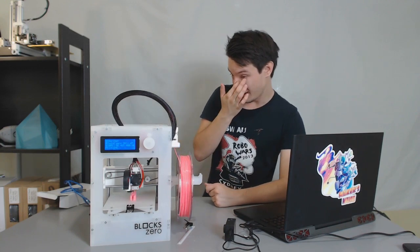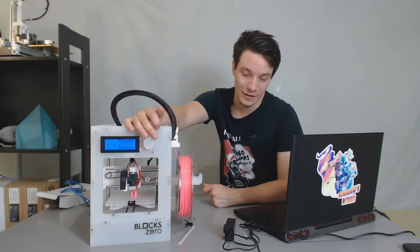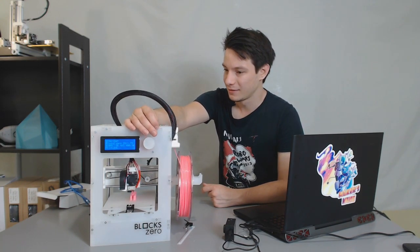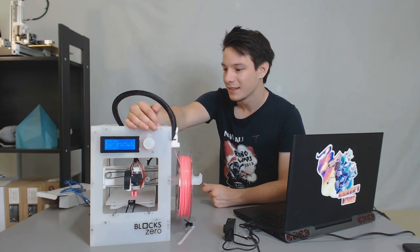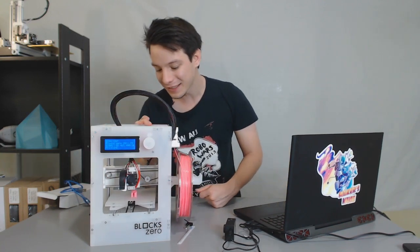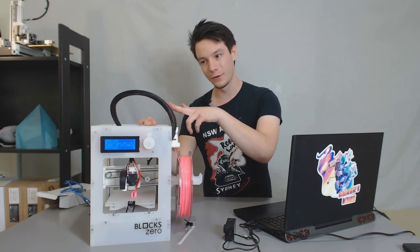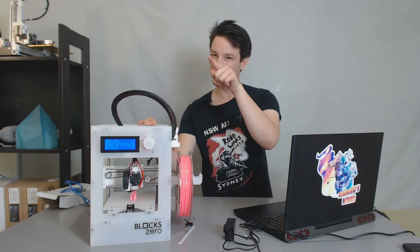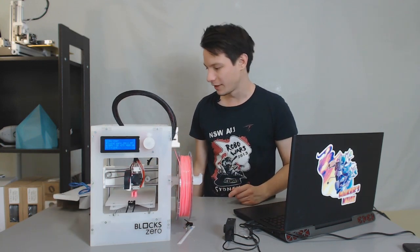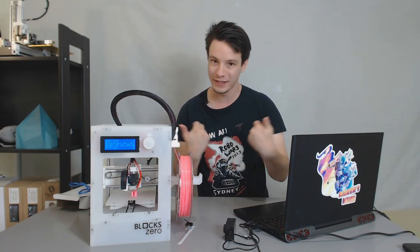I suppose the only thing to watch out for with acrylic frame machines is, if you get the kit, don't over tighten the, what are they called? The T-slot nuts, because you're putting a lot of stress on a very brittle substance, and the laser cutting doesn't have any relief angles. So when you laser cut for this design, you generally want to do a little internal relief. Can't draw it, no pen.